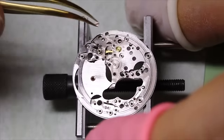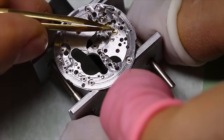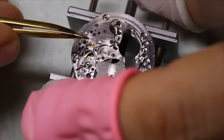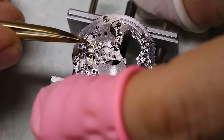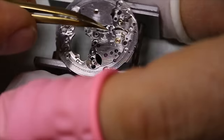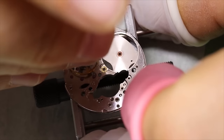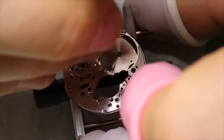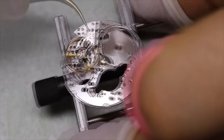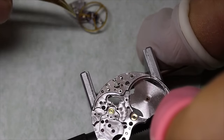We saw in the strip down that the shock setting is actually different from the dial side to the train side — not sure why, but that seems to be common on this movement. There is a lot of unusual stuff going on. It is clear there were fewer constraints on the development budget back in those days, with a lot of over-engineering as we discussed. Before moving on we want to make sure that the balance swings as freely as possible. It is a good habit to check that the oil bubble is in the center of the end stone. With a high magnification eyeglass or microscope you can see a donut of oil around the pivot — if that donut is contained within the diameter of the spring then you have done a good job. When we are confident the balance runs freely and is well oiled, let's put it back safely.